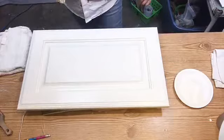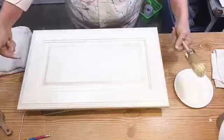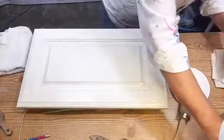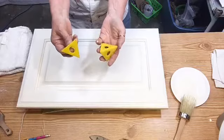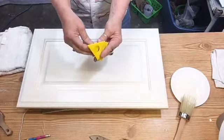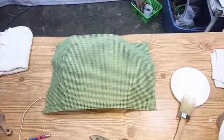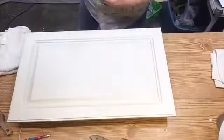That is one door and I'm done. If you're doing kitchen cabinets you want to do your backsides first, let that dry, then move to the front. You can get these little door supports at Home Depot or Lowe's hardware store to set your doors on.